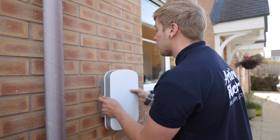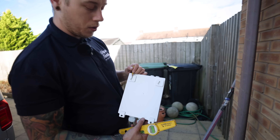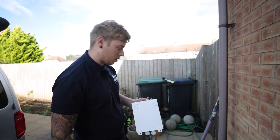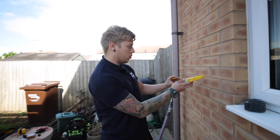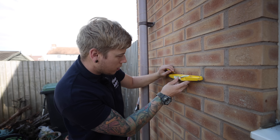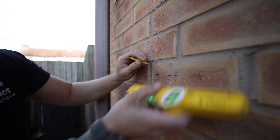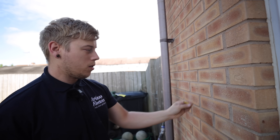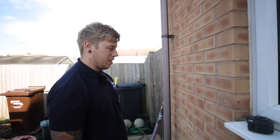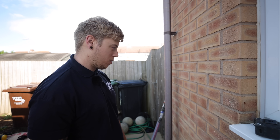A little tip with the Hypervolts - because you've got to hook the top two on before you can mount the bottom two, to make sure it's spot on and level, measure the distance between the two holes. When it's on the wall, that's your center line. As long as you've leveled your two top holes, drill that hole and that hole, it'll hook on and you know it's perfectly level, then you can mark your bottom two. It's a bit of faffing around with the whole install procedure but once you know you've got it right there's nothing to worry about.